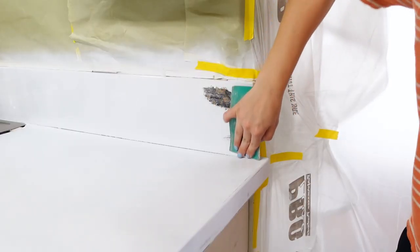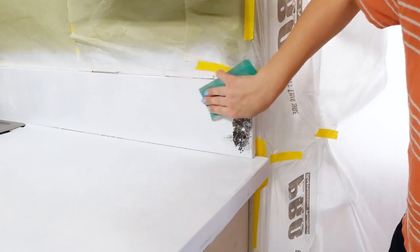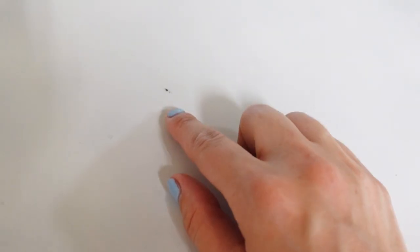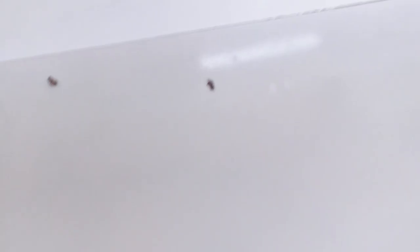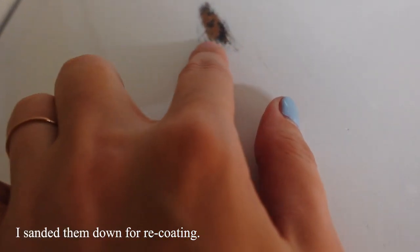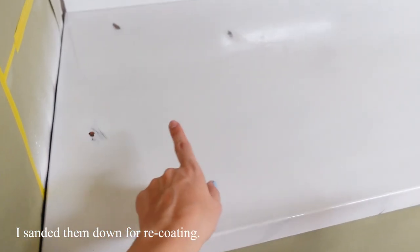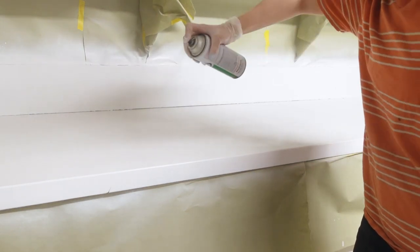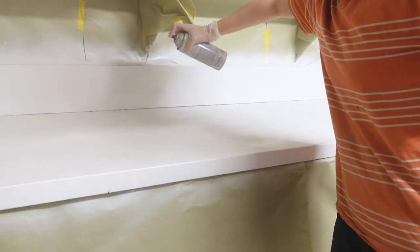After a week I decided to do a few things differently. I first sanded the areas that had that scaly, curled-up texture, then sanded the whole countertops down so the second coat would adhere better. I also noticed some areas looked like scabs of paint were coming off — even though I had washed and degreased the counters, some dirt still managed to get in there and it was coming off with the paint. This is one of the biggest reasons why, if I were to redo this, I would never use spray paint again.